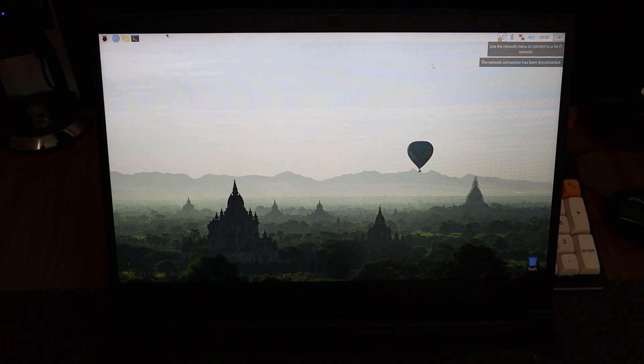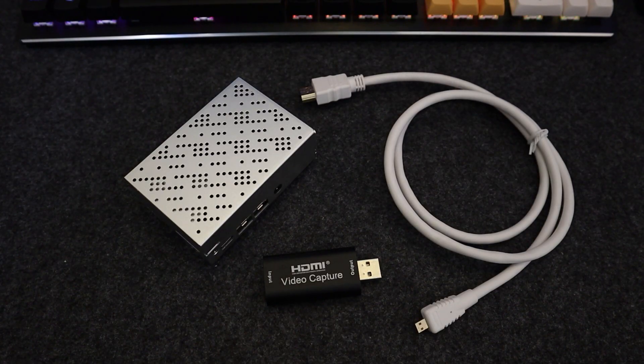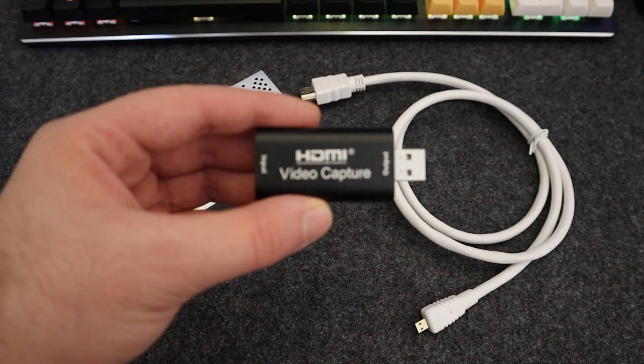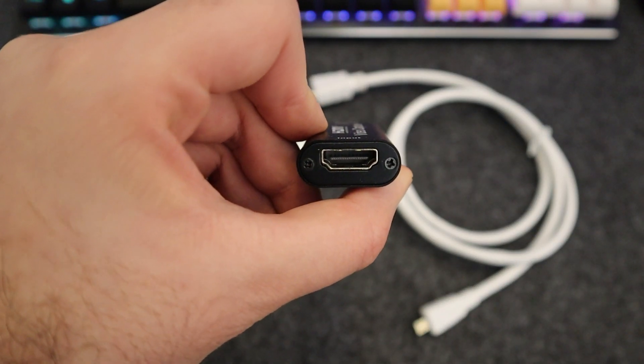In this video I'll show you how to connect your Raspberry Pi to your laptop monitor directly. Many of you may have heard that you cannot connect your Raspberry Pi to your laptop monitor directly, because the laptop HDMI port is only for output and not for input. This is true, but I've managed to solve this problem with an easy solution — getting an HDMI video capture card for five dollars. With this HDMI video capture card we are able to connect our HDMI output and input it into our laptop via USB.